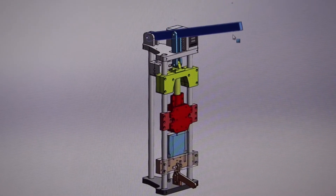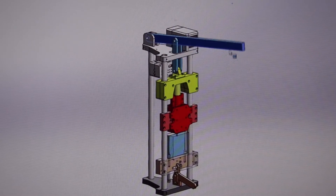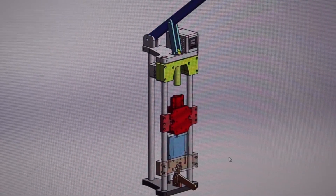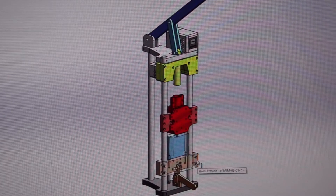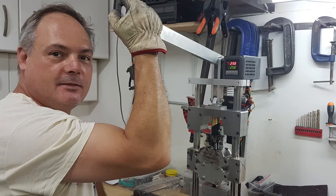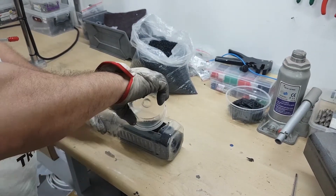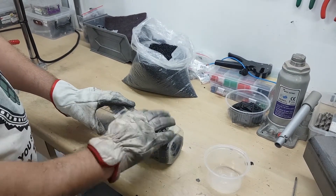On the mechanical design side, I've used a lever that pushes a piston down into the melting pot. The mold then comes up from the bottom and locks in place ready for injection. For refilling the pot, I just use a bottle with a flap cut into the back of it.